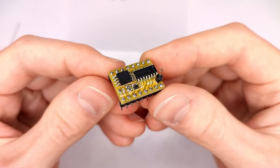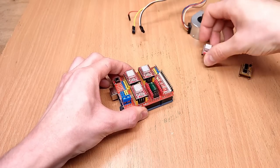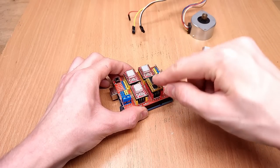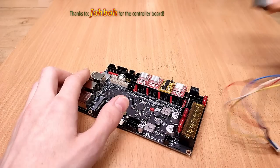Today I finally get around to building my newly developed compact version of this stepper motor driver, which is not only compatible, but also plug-and-play interchangeable with the standard A4988, allowing me to literally retrofit existing RAMPS 1.4 and CNC shields and many other common 3D printer motherboards with unipolar motors.